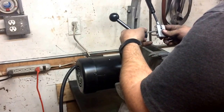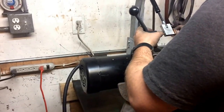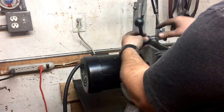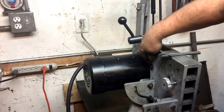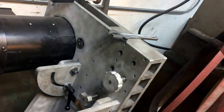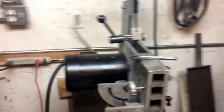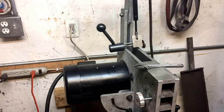Floating it out in the air makes it a little easier to understand. This being your pivot and that being your stop pin — the stop pin just pushes the paddle back and forth, which moves the arm up and down. The travel is limited by a pre-cut arc in the side of the grinder body, about 120 degrees. There's the center pivot hole and there's the arc cut for the stop pin travel. I designed it this way so I could put the handle on one side or the other depending on personal preference — kind of an ambidextrous design.